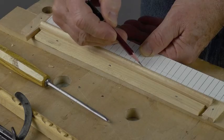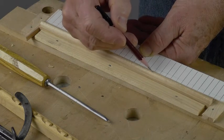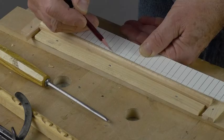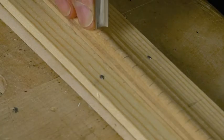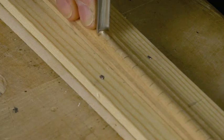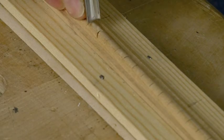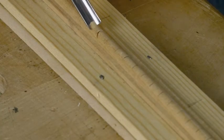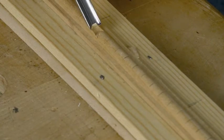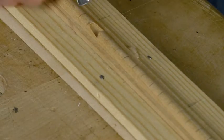This will be a unit, and this unit is the same width here as the width of the astragal itself. So put in a few of these steps like this, and then we're ready to cut into the wood. So the thumbnail involves starting with a vertical stab cut like so. You don't need a mallet, just push it straight down into the wood, and then coming to the next unit, or just before the next unit here, you make a scoop like so. And depending on the wood, you might have to go back, clean that up. So there's our little thumbnail coming down like this.